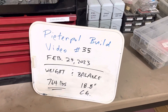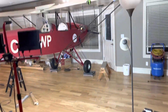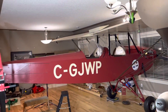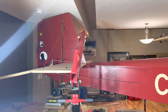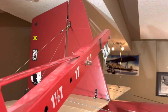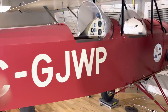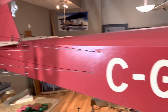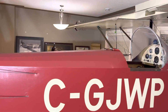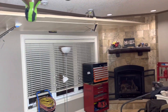The center of gravity is supposed to be between 15 and 20 inches. Let's go take a look at the madness. All assembled in the garage — the tail is up. We had about one inch clearance between the tail and the roof. In order to get the main gear on here, we level it — this has to be zero and flat. When we did all that with the scales, we just barely cleared the light over there, and this one too. And the wings all fit.